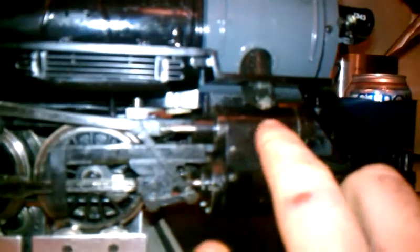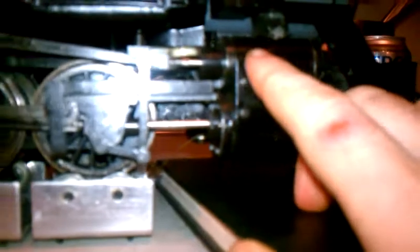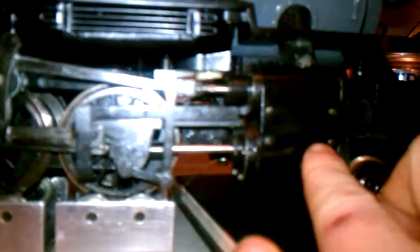yeah, you see down here, when the main driving rod is at the bottom, that's when this cylinder is going to want to push. So this will pull this valve in here to that side and send steam to the back of this cylinder, and this side of that cylinder will be going to exhaust out the stack. When the wheel comes back around to the top, then the timing is set up so then it starts to pull. Steam goes to this side of the cylinder and it's pulling, and the spent steam from the last stroke when the driving rod was at the bottom goes out through the top and out the exhaust.